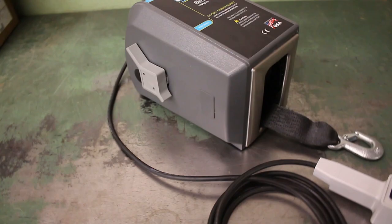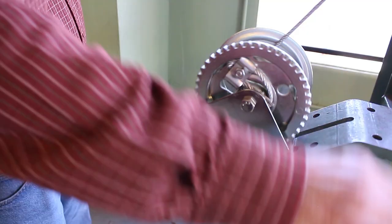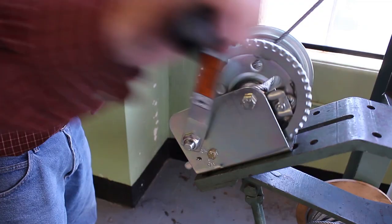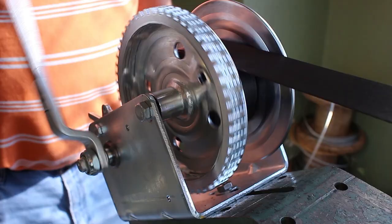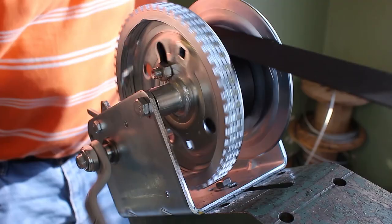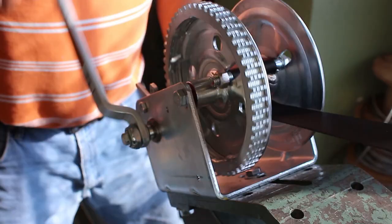Pulling winch models DL400 through DL1300A and DL3500Bs should always have cable or strap coming over the top of their reel, while DL1402As through DL3200As and all DLX models are a special case. Almost everyone has cable or strap go over the top of the reel on these winches, but flipping the direction of the reversible ratchet lever allows for the cable or strap to be changed to going under the bottom of it, between the reel and the base.